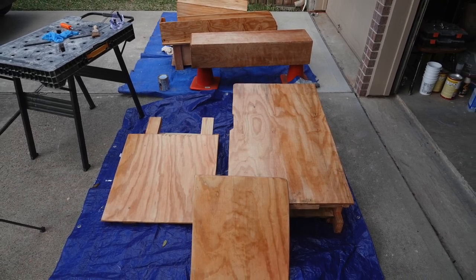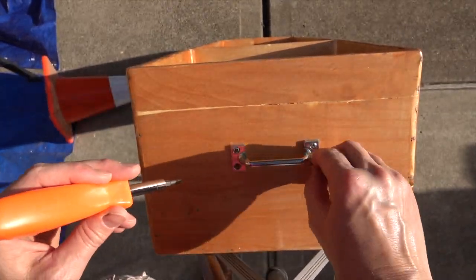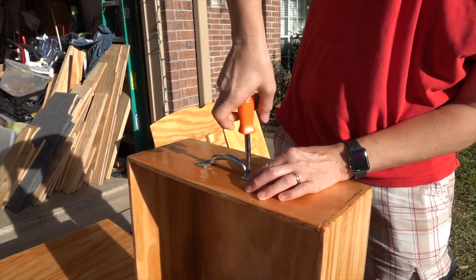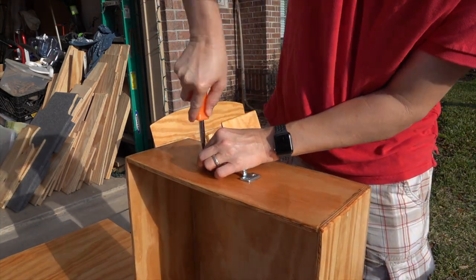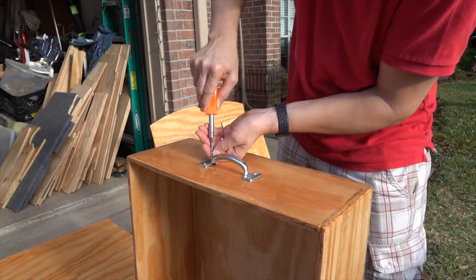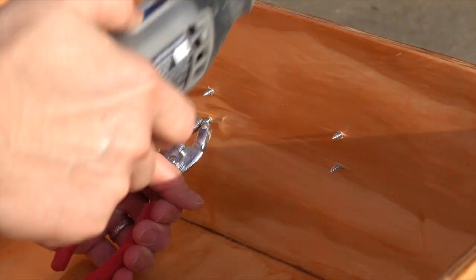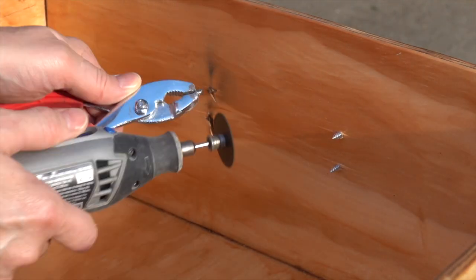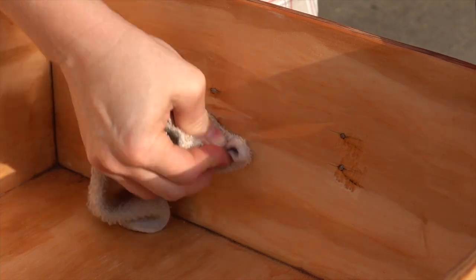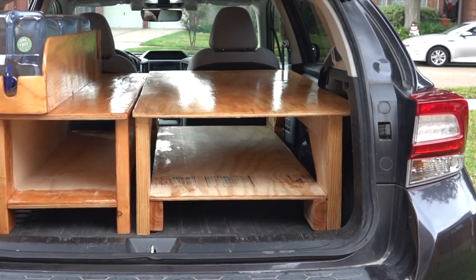Now I'm putting the hardware back on the drawer. That little crack along the top is because when I initially built the drawer I didn't have a full piece of wood and combined two pieces. I took off that ridiculous extra block I put in, put some screws through to the other side, and used my Dremel to cut the protruding screw tips off — the Dremel has been very handy throughout all my builds. Why I didn't do this in the beginning I have no idea, but it turned out fine.